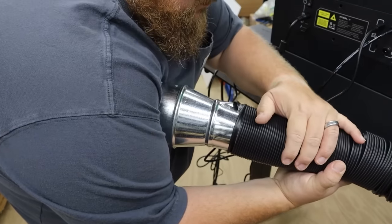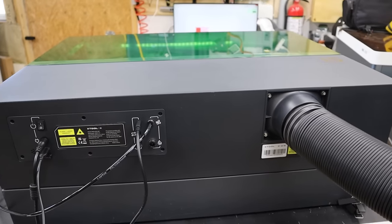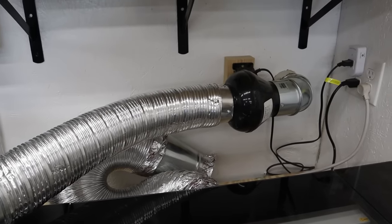Fume extraction on this machine is good, although you'll definitely want an inline duct filter to help supplement it. As far as duct size, this is a three-inch duct — I was hoping it would have been a four-inch, but it's still three-inch. Seems like X-Tool is stuck on that three-inch diameter across the P2, S1, and D1. I go to the hardware store and get an HVAC rigid coupler adapter that goes from three-inch to four-inch, and then from four-inch to six-inch for my main fume extraction. I definitely like to run as large a ducting as possible. The last thing I want to talk about is more of my personal workflow than a real complaint, but I'm going to put it out there anyway — the more information and opinions I can give you, the better informed you'll be.